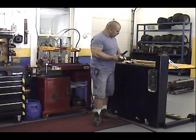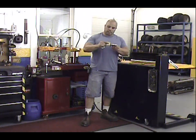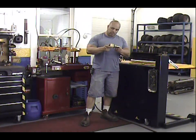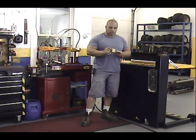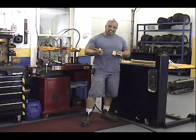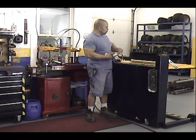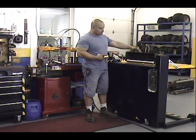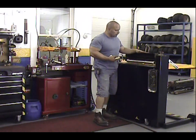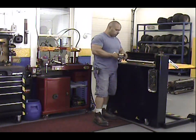Let's go ahead and we're going to start with the Simplex bed knife facer. I have a 15-degree nylon pad on here, which works really well with my Flex 21s and my T-mowers. Likewise with my 3000, 3150 triplex mower reels also. We have here a reel from the 3150 triplex unit made by Toro. And we'll go ahead and try that.